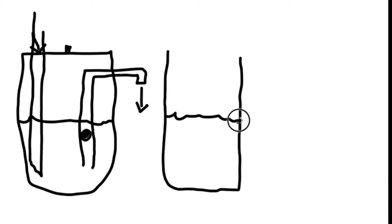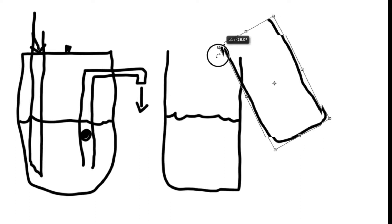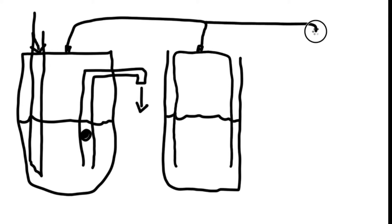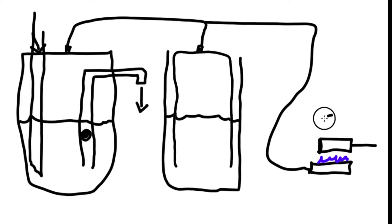There's a second barrel with an open top which also has water in up to about this level. Then there's a third barrel — the one we're looking at here — that also has an open top, is slightly smaller, and we turn it upside down and stick it into the second barrel to collect the gas. It goes up and down as it fills and empties with gas. There's a pipe that goes off to a barbecue or cooking stove where you burn the gas. That second barrel has to be airtight to collect the gas, so having two holes in it isn't ideal.